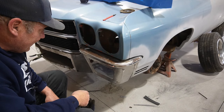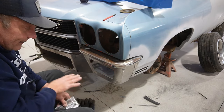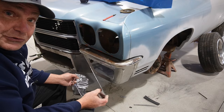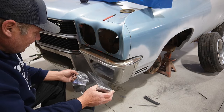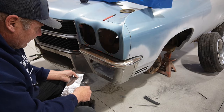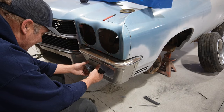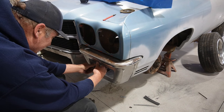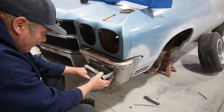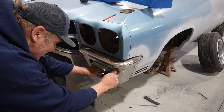All right, so I got the holes cut out on both sides, and as we were talking about trying to form that shelf, that inset thing in there, I was going to try and bend up the center, but didn't have either the tools or the skill set to make it all in one piece, so it ended up in a couple of pieces here. Had to do some relief in the back for the bumper brackets and radiator support and various crappage that's back there. But my thought is, since I couldn't form that all in one, when I bent these up, I just did the whole trace around and cut it out, but I can put both of those sides in there, if I was coordinated to do it all at once.